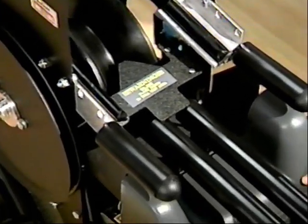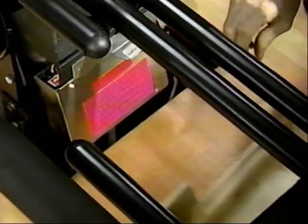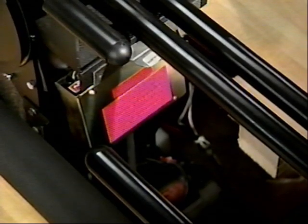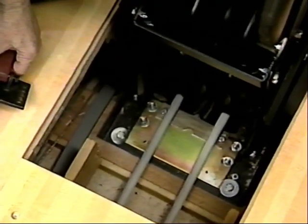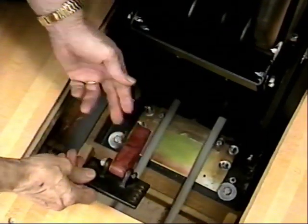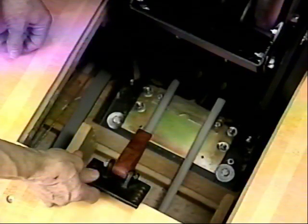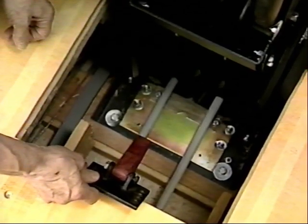Should we need to get access to the lift motor, we can take a lower cover off where we find a removable section of flooring that would allow us access to the lift motor as well as the control box. One of the components of the underlaying ball track assembly is the ball stop, located just in front of the ball return, so that in the event of a ball return failure, a ball cannot roll back toward the pin spotter.